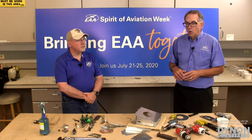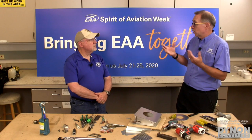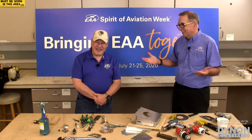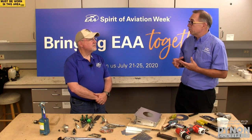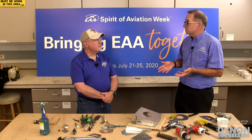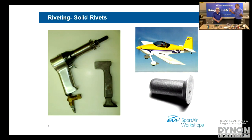Sure. So we've talked about the two most popular kits right now, standard kit and quick build kit, or slow build, fast build. Exactly. And then there are two paths in terms of the primary construction. One is primarily what we call solid rivets, which is a standard technique that has been building aircraft forever, since the 30s. And then using pull rivets. Pull rivets have been around for a long time. Pop rivets, as they're called, as a kind of generic term. But we're using commercial or aerospace quality rivets.